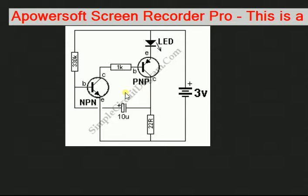And I do like this one too, because it'll oscillate faster if you found collector and emitter reversed. Which makes a nice feature on it. So if you're looking for finding the collector and emitter, you can just reverse it, and then it will be faster. The one that goes slower will be emitter base. Emitter collector will be actually in the correct position. And that's very much to it.